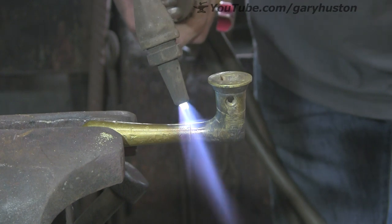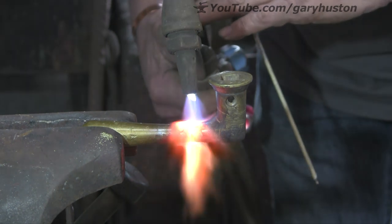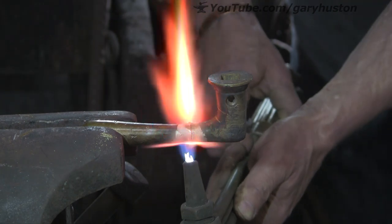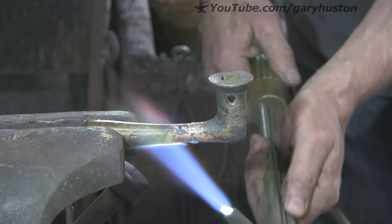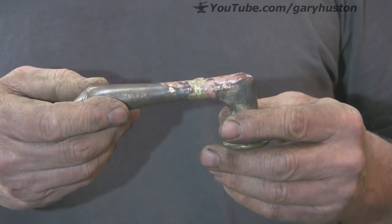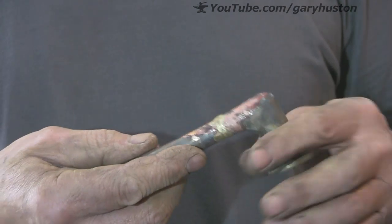I'm going to get it hot from both sides so that the solder will run right the way around, or right the way through. That's got it. You can see it went then. So we'll let that cool down. Took quite a while to cool down actually, surprisingly. Now it looks like it's got it — it's got a nice lump on the back there where it ran right the way around. So we'll give it a file up and try and clean her up.